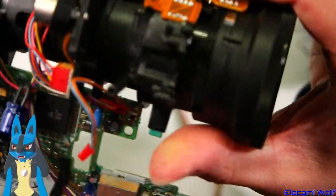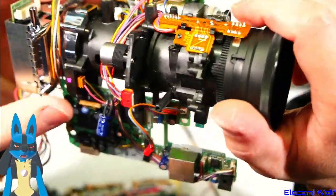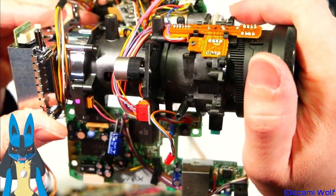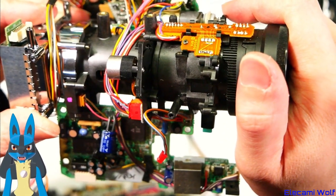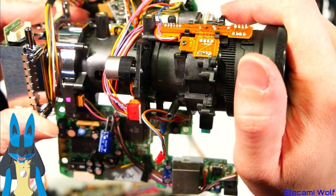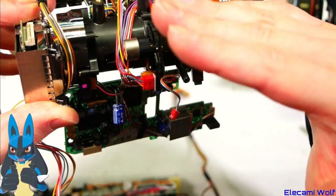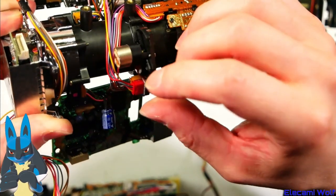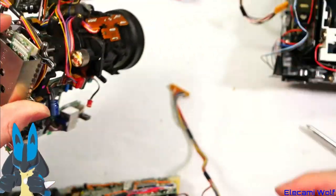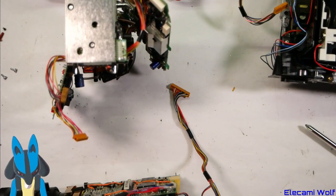I did look into how the iris motor things work — it's two coils. One's driven, and then the other one is a feedback or dampening coil which provides a velocity or movement signal back to the little control amplifier that's driving it. So as it starts moving faster, it tells it that it's moving fast and stops pushing as hard. So it gets a very well-damped movement — it starts pushing hard, and as soon as it starts moving it dials back a bit, so the motion ends up self-smoothing. A drive and a feedback — that's how those things work.